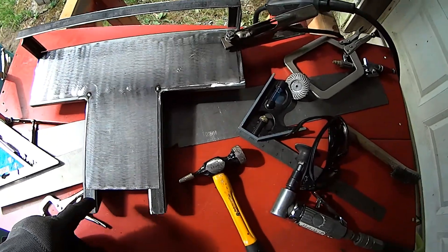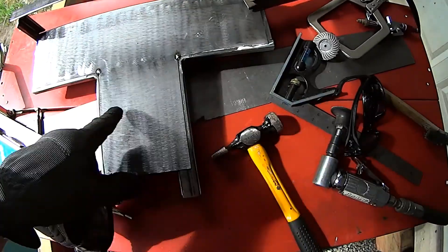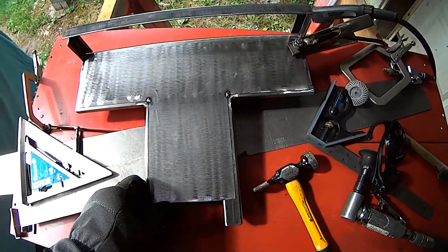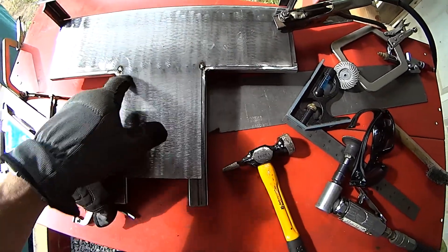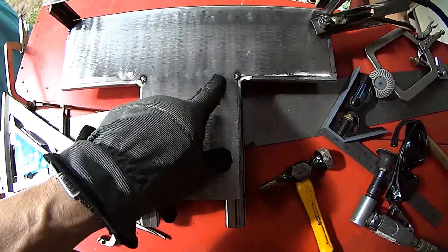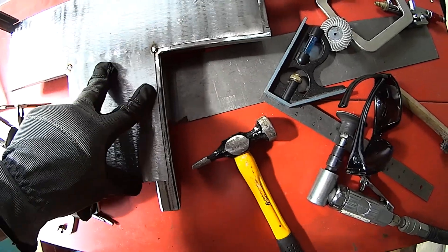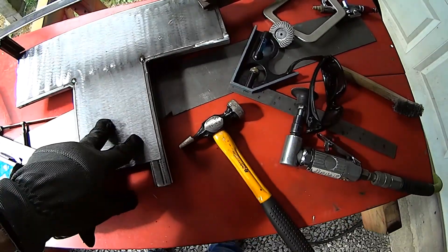This piece is undersized for a reason — it fits in there so I can tack it without worrying about grinding a bunch of stuff off to fit my other pieces. I can just by eye narrow the gap all the way around and spot weld it. I spot welded it in the middle instead of at the top or bottom — I work my way from the middle out in both directions. That's how I like to tack stuff together so you can catch alignment issues pretty quick.